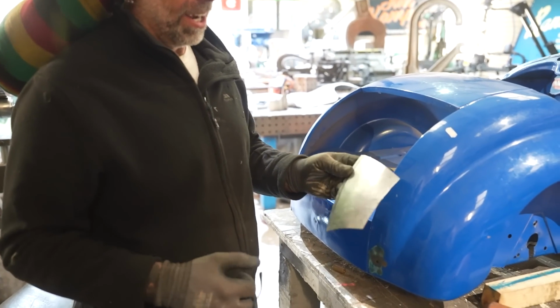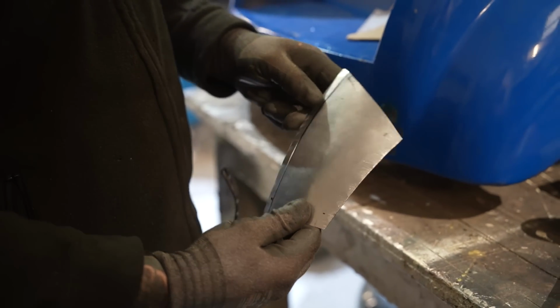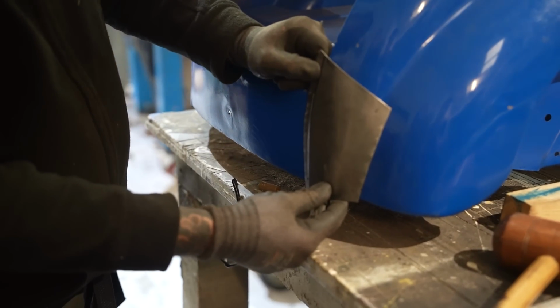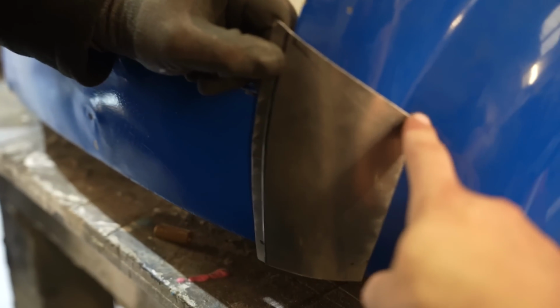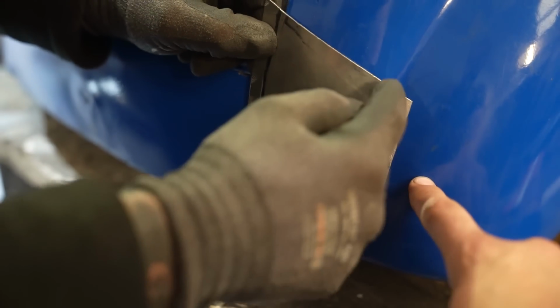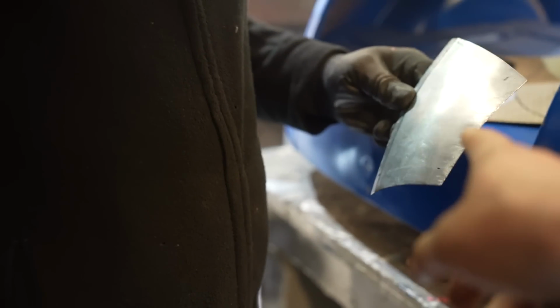John is still hammering away on his panel. Can we have a little update, John? Well, I think it looks all right. Those are my hammer marks. I just started to try and tip that edge, look. Once you tip that edge, you're committed. There's no going back. Well, you haven't left enough there, because this was supposed to go into this one. Yeah, but there's not enough on that panel, is there?